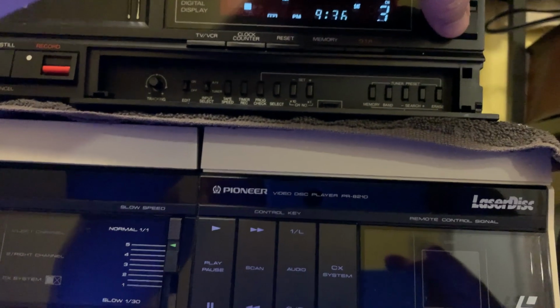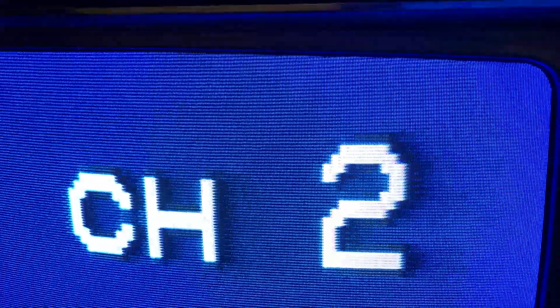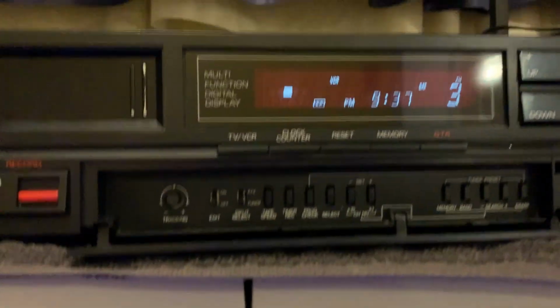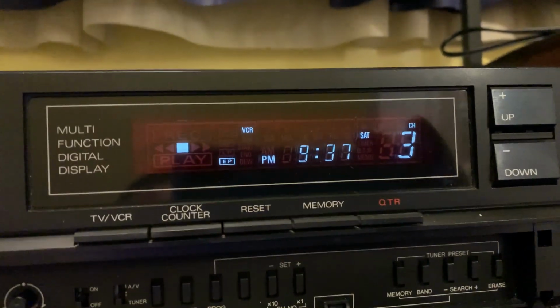So just like that, as well as when you're changing it on screen. I really like how these older ones did that. Also, the on-screen display is full 480i equivalent. It actually is interlaced, unlike the newer ones where they just made it equivalent to 240p, with that double strike method like the older video game systems used. So that's nice, it doesn't do that. It's real smooth. So yeah, you can program the whole thing from the front of the unit and also using the VFD display.